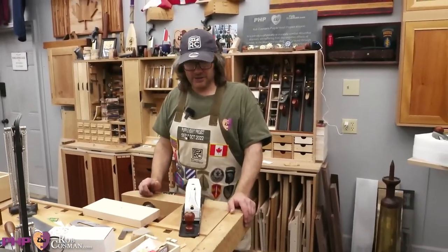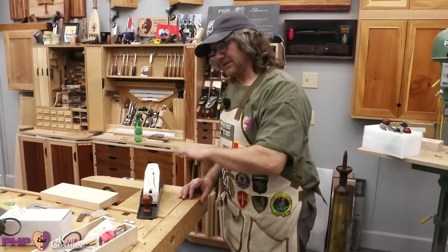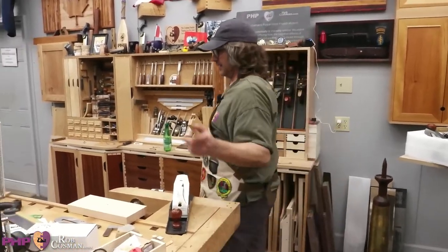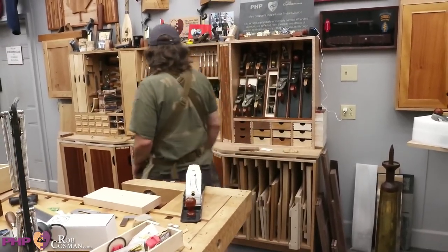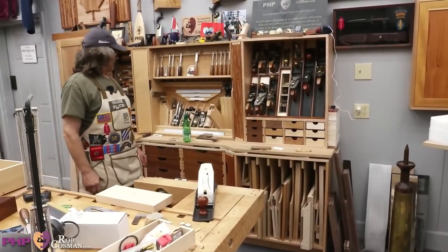So that's going to allow you to go back in and pick up a 6,000 grit stone. Because in doing the backs of your chisels, you can't go from 1,000 to 16. You got to put an in-between step. So you might as well get the apprentice kit. The apprentice kit includes the 6,000. You got your three chisels. You got your plane.